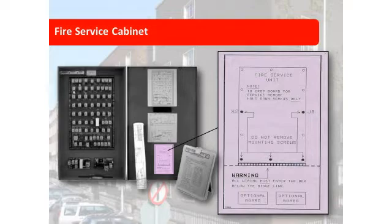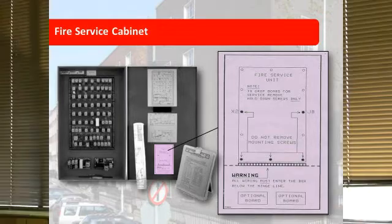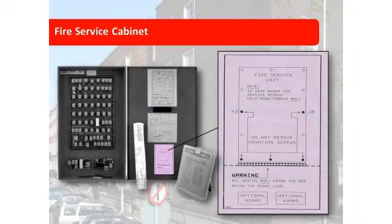So that's what we're trying to tell you with this little sticker that we put on the door. All wiring must enter the box below the hinge line, down here somewhere, so that when you wire it, this thing can still swing out if you need to swing it out. Now, we generally don't have you guys touch this thing. This is for the future, in case a repair has to be accomplished after the installation. Generally, if we miss the boat and we screw something up, we'll send you a panel. We don't ask you to do that. We'll just replace the panel. But if it's wired correctly, replacing the panel is not a big deal either. So that's what the sticker is all about, and we actually tell you how to drop it. To drop board for service, remove hold down screws only. And then we identify where the hold down screws are.